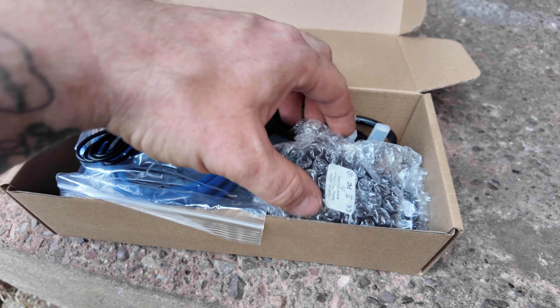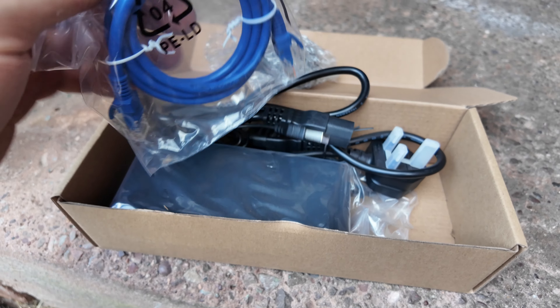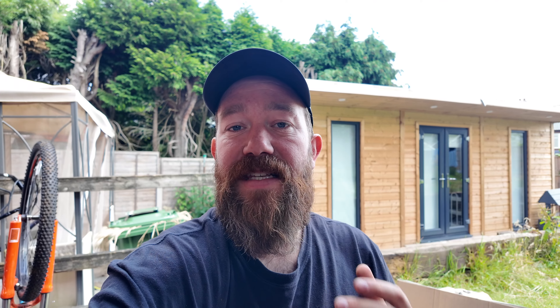My house already has cameras wired in Cat5, so all I need to do is switch the ends over to RJ45 — one end plugs into the DVR, one into the camera. The DVR comes with a mouse, power supply, and a network cable for connecting to the internet so you can remotely view, access, and control the CCTV system.